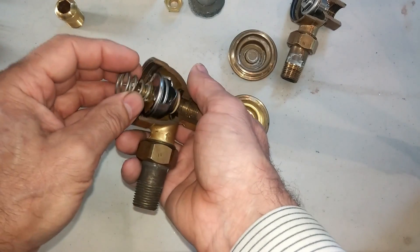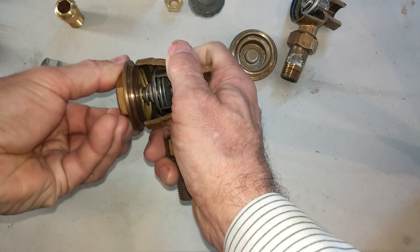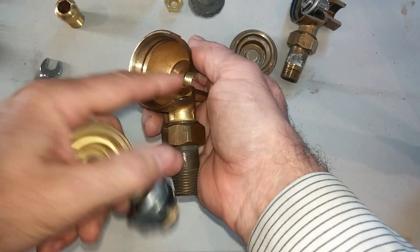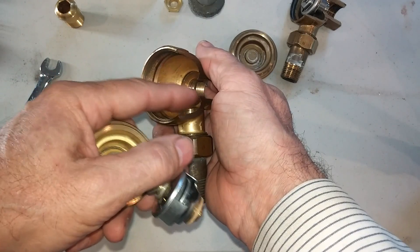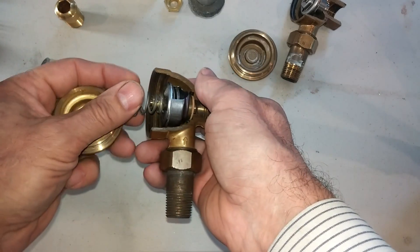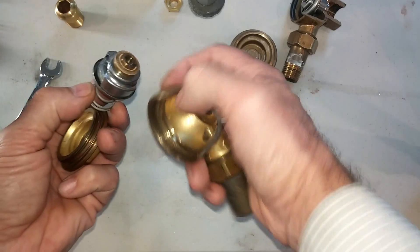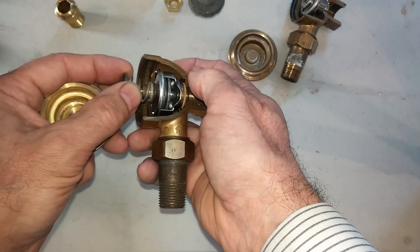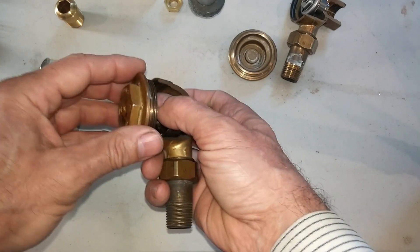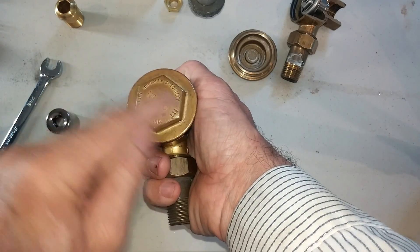The capsule goes in place here. Before you put it down, make sure the mating surface is clean and free of any debris. I'd put a little anti-seize on the threads and a little smear on the gasket to help — so if you ever have to remove it, you're not damaging the seal. This gasket tends to stick over time, and as soon as it comes apart you can leave part of it behind, making cleanup harder. Then put the cap on and I'd mark it to let someone else know you've rebuilt it.